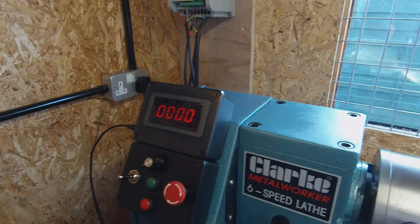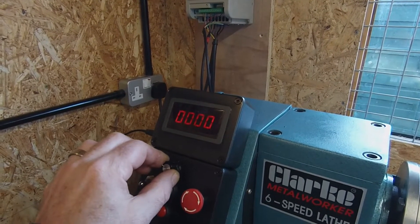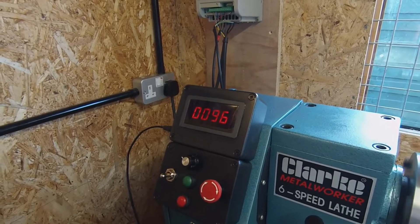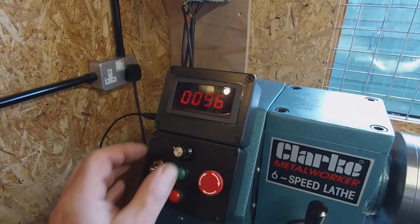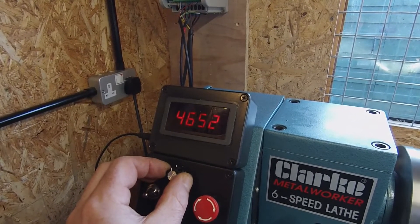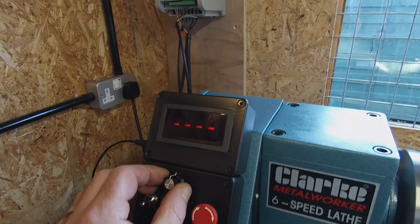At the moment you can hear the radio as we start. As you can see, that is interfering with the radio, so I'm going to have to do some EMI suppression on this. The TAC is working, kind of - I just had this little run up yesterday and it seems to be out. And you get that - it's all over the place. I think that is also due to the EMI suppression.